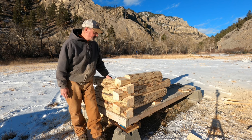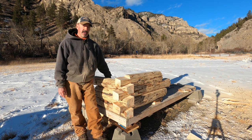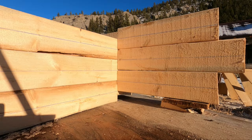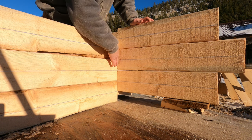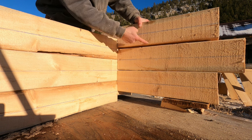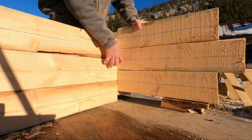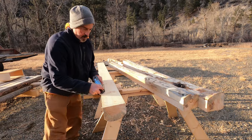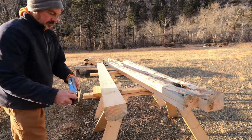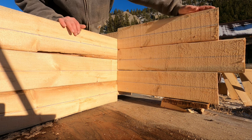One more thing — I'll turn this around so you can see the interior with the sun hitting it. I like to bevel the inside edges of the corners of these logs; it makes for a nicer look on the interior of the cabin. So here you can see a pretty nice inside corner. Beveling the corners of every log on the inside gives you a nicer look at this joint, and it would also allow you to do a very small chinking right here — basically sealant if you want to seal the interior with caulking or log cabin chinking material.